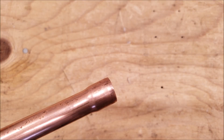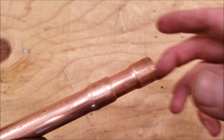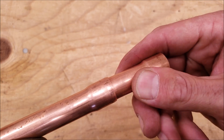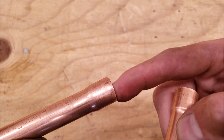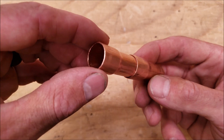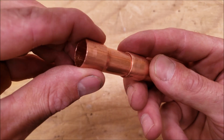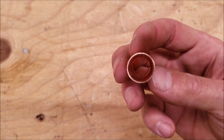So that's how you do it. As I put this in here, you can see there's not a lot of slop — you want to hit your swage in straight as you're hitting it. Here's a close-up of that swage. You can see that it fits in real well and there's not much space around the tubing. That would make a good swage in order to braze with.